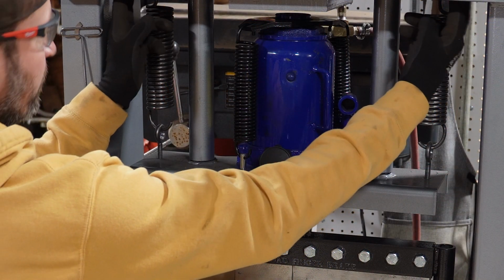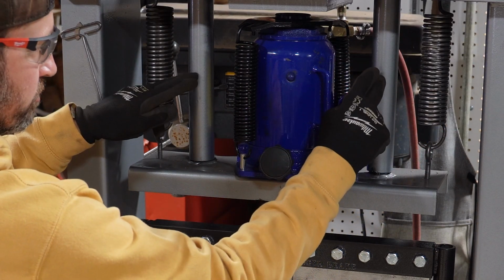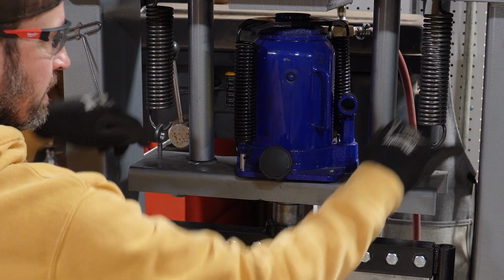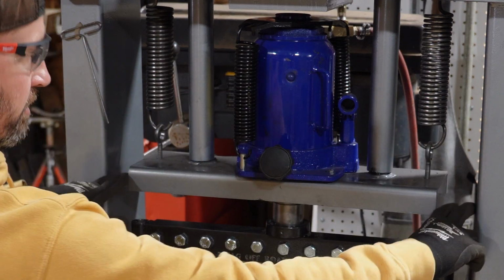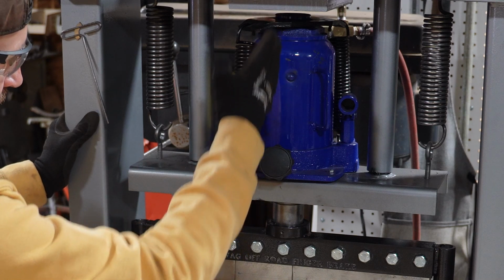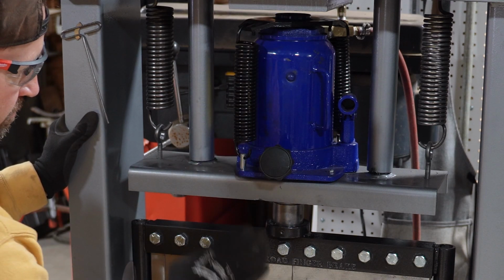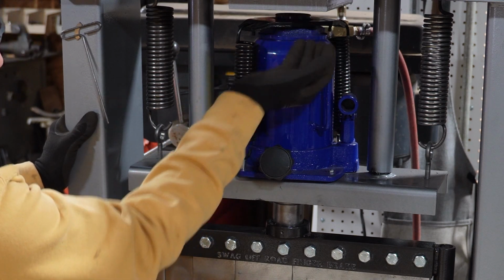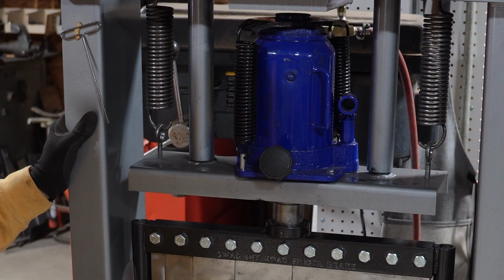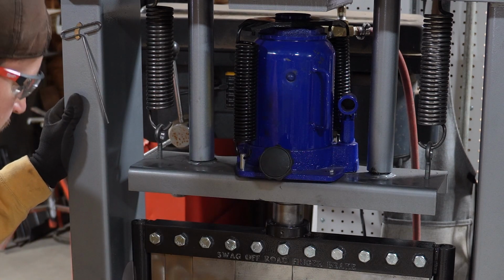There's a plate up under here that's not centered. That plate holds these down tubes, which are not centered. Everything shifted over. You can even see right here, it's not centered. But as long as your main drive point or push point is pretty much centered up from the brake, the jack, and on this plate up here, you won't really have a problem. It would be better if it was centered, but it shouldn't be an issue here.